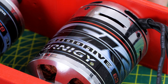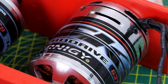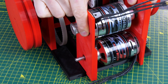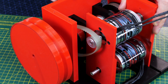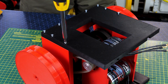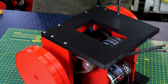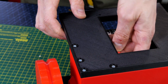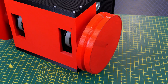The motors are the ones I normally use which are the Turnigy Aerodrive 6374 149kv motors, which are basically massively overpowered so we should have enough torque and enough velocity. The motor fits into a slot so it can slide up and down, and that allows me to tension the belts - this is exactly the same as the rotoped design. With the back and front screwed on we can tension those belts up, done with a little wedge that fits in the slot and is stuck in with sticky tape.